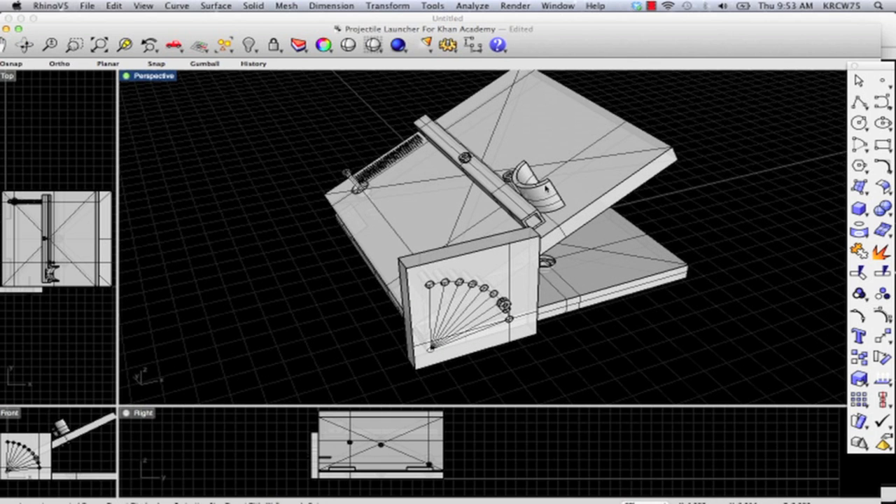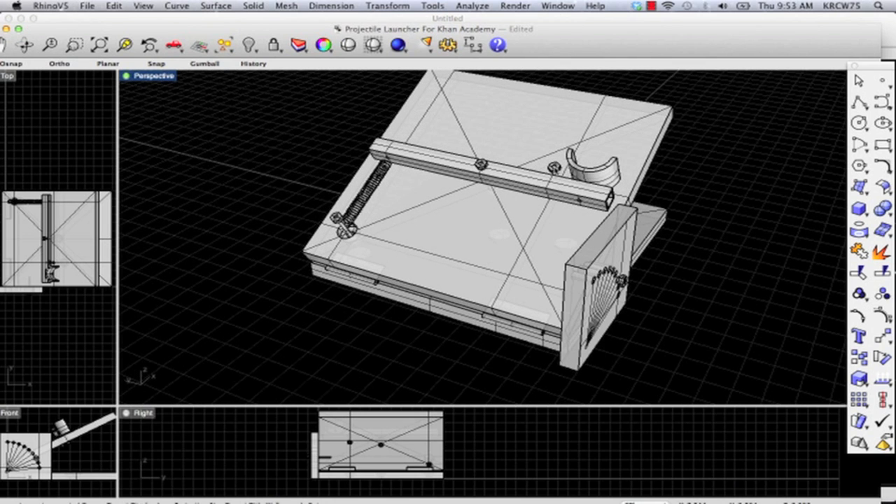There's another piece right here — this is a piece of two-inch PVC screwed onto a three-quarter inch extruded aluminum piece, connected with an 8/32 by one-half by one-and-a-half inch machine screw. We have a stop that's a five-sixteenths bolt which causes the bar to stop so the ping pong ball is released. The pivot point is also a five-sixteenths bolt — two-inch long bolts. The piece of aluminum here is extruded three-quarter inch square tubular aluminum and it's 11 inches long.